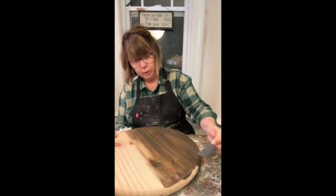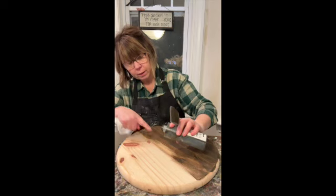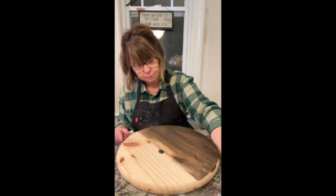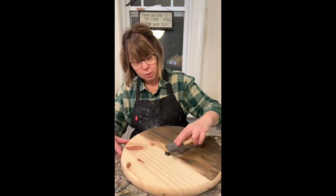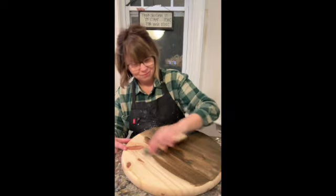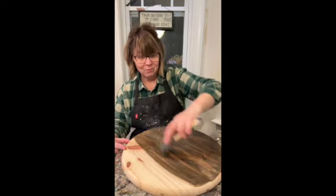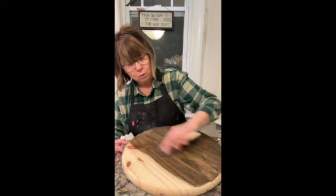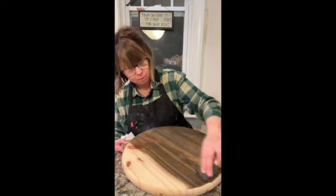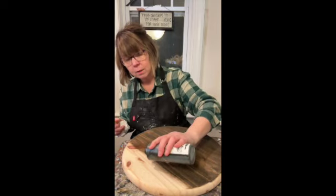I was going to wipe it off but I think I'm okay, actually — I think that looks really good. Just a little bit, don't go crazy. I'm going to get right down there to the edge where you put stain the first time so that you don't end up with a dry edge. You've got to move pretty quickly with stain when you're doing a piece this big. The reason is it's soaking in the second that you start, and you don't want to have weird lines on your piece.